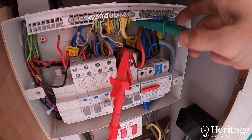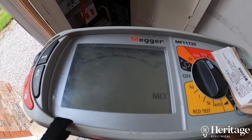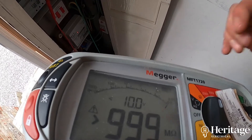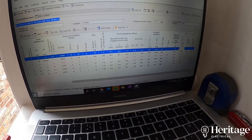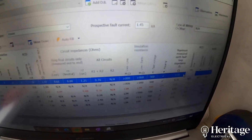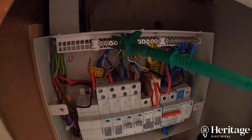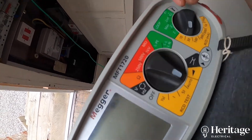Bear in mind this is just a quick overview of some of the tests — I'm not showing you all of the tests we do. These tests are required for each circuit, and if we don't have comprehensive test records available, we will need to test every accessory, socket, luminaire, or lighting point. That's why this particular installation is taking us the best part of the day. You can see the types of information we record for each circuit: type of breaker used, cross-sectional area of the cabling, maximum permitted Zs and whether the circuit passes or fails. We also test to make sure that the RCD component of the RCBO is tripping in the correct time — that's me setting up my meter for an RCD test.